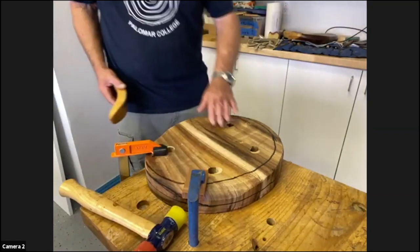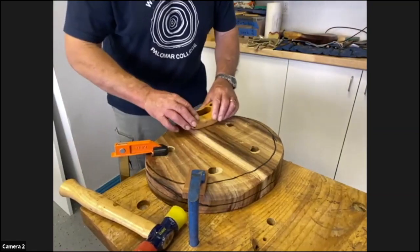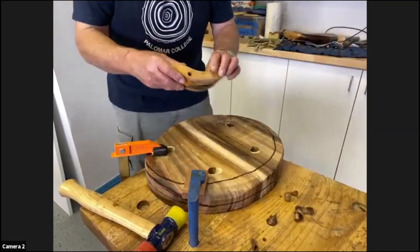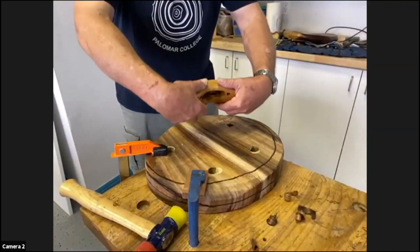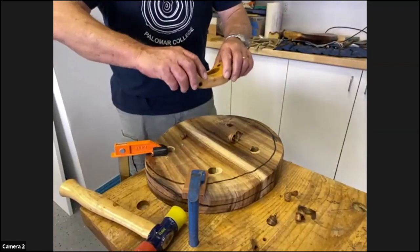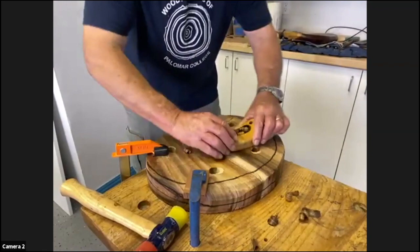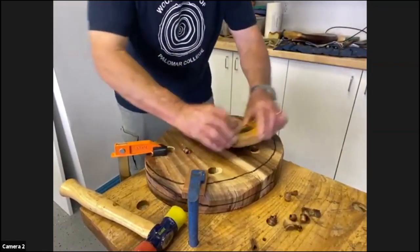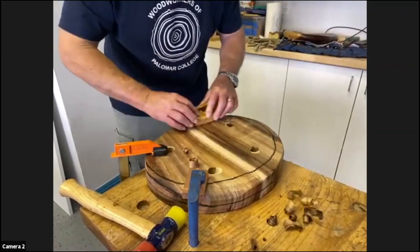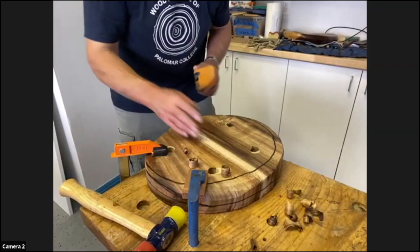The travisher will work with the grain and it leaves a beautiful polished finish. It also works very well across the grain. I'm just going to work at it for a few minutes. What I'm trying to do here is create a ridge along this back line — I'm going to leave that high, but eventually take it down probably another quarter inch at least. Then I'm going to have a bevel along the back edge and a little bit of a bevel along the front edge. There are a few different angles and shapes, things you couldn't really achieve with a machine. When you're working, you see a curve or a line that you want — go with it. This is your own work. When you get one of these, you can buy it in a kit or buy it complete. This was a kit I ordered from a company called the Windsor Workshop in England.